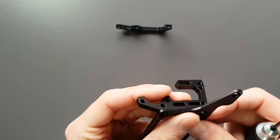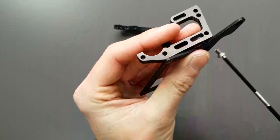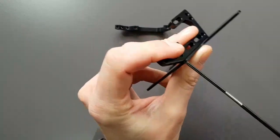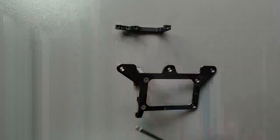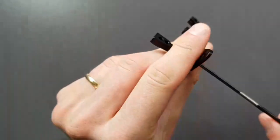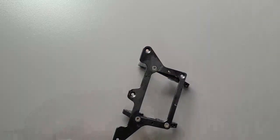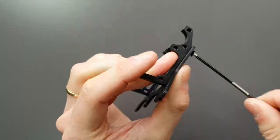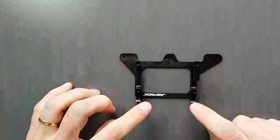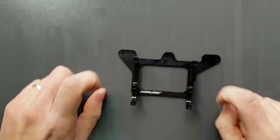You need to mount them. Push them against the aluminium pod when you tighten the screws down to make sure that they're sitting flat. Do the same for the left side. Once that's done, make sure you tighten them down properly. Put it on the board again and check that it's completely flat. You shouldn't have any sign of bending, and you need to keep checking for straightness through the building process of the rear pod.